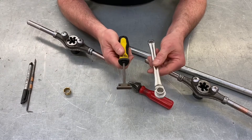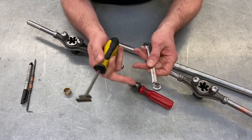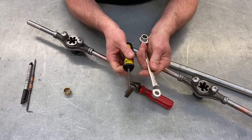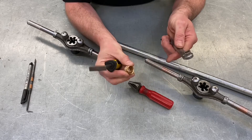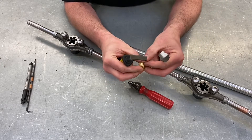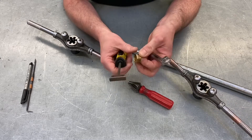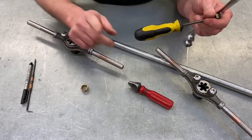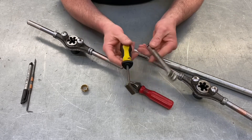We've also got a couple of bush spanners. Both do 20 and 25mm. We use them to tighten up bushes — remembering a male bush is tightened into a box or coupler like so, in order to get it tight. Bush spanners also appear in exam questions and on tool identification lists at level one.